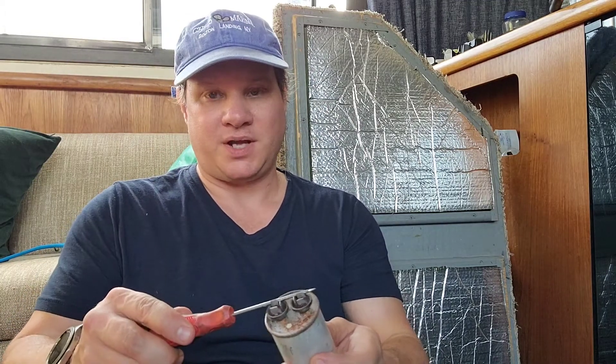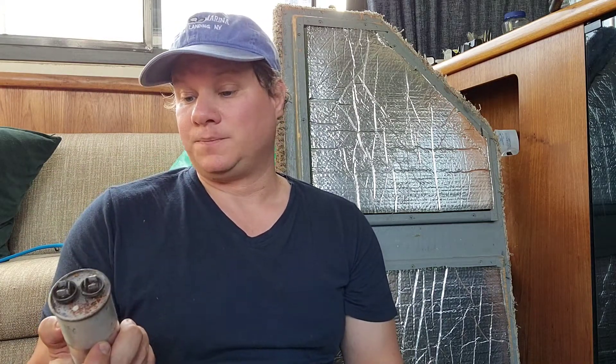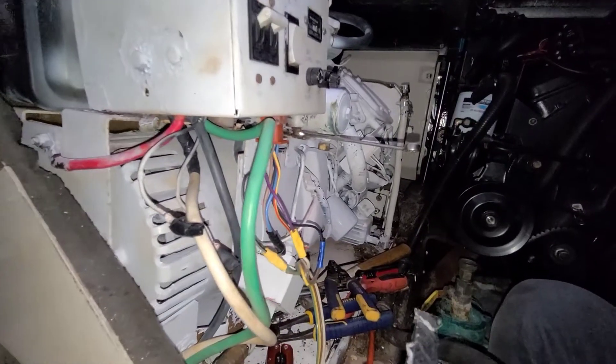I'll short that out so I feel a little safer. What I'm going to do is go down there and re-terminate the ends that connect here — this was so rusty, maybe that was the only problem. I'll probably still end up replacing it, but since it appears to be testing within spec, I'll see how that works. Let me go get the parts I need to make the connections.